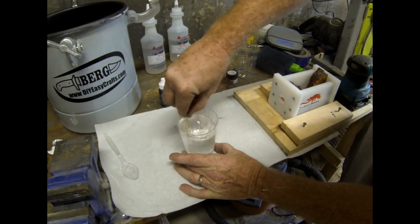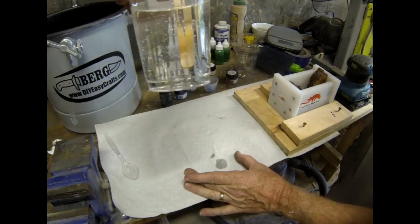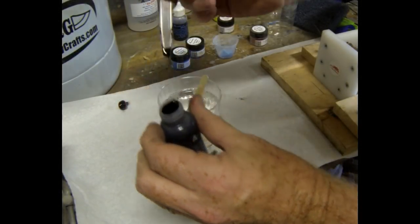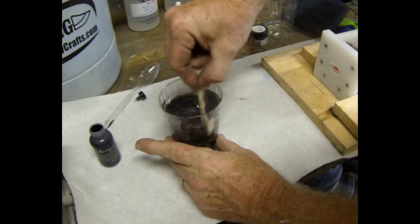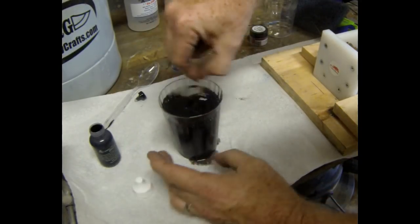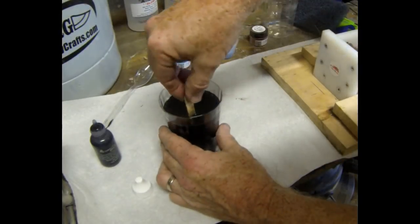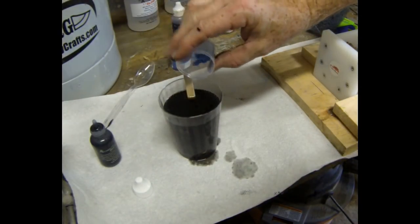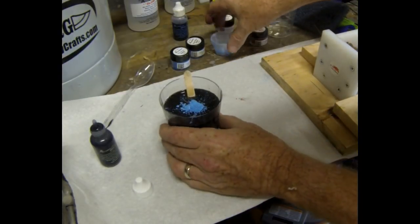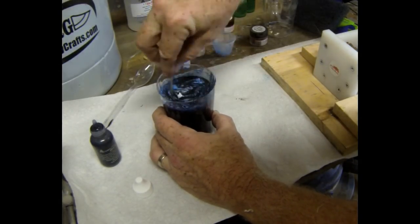You only have a working time of probably about 12 to 15 minutes with this product, but it really needs to be in that pressure pot as soon as possible so that the bubbles have a chance of reducing in size before the resin sets. When you're adding color to Alumilite, you only need the smallest drop of the dye — the smallest drop will add a lot of color. I'm also going to add some additive: a blue pearl, just to add a little additional color into that black resin.